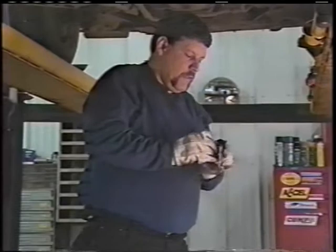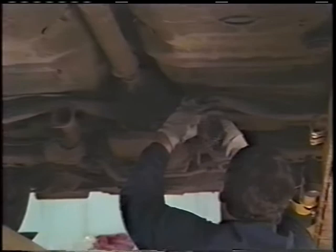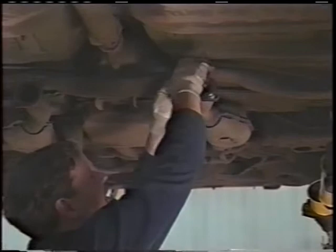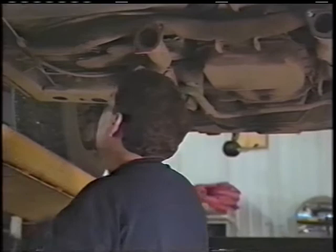I'm going to bolt this flange system and gasket up to the old catalytic converters. We'll bolt that into place. We will just snug those bolts. We won't tighten them yet. There's a reason for that as well. If you were to tighten those bolts, you'd actually bend that ear over, so that when you welded it, because you've got your gasket surface in between these two flanges, if you physically went down right now and super tightened that, it would squeeze this together and leave a gap in here. Then when you weld your new pipe in, you've already got a bowed flange. There's no way of straightening that. So you'll need to remember not to bolt it tight, just to snug it up until you get ready to do your final, which means you'll do your weld and then you'll tighten the flanges up solid.